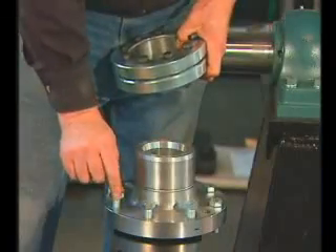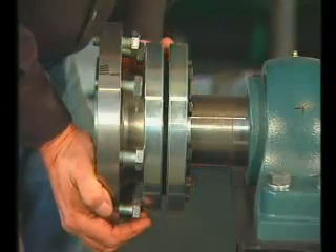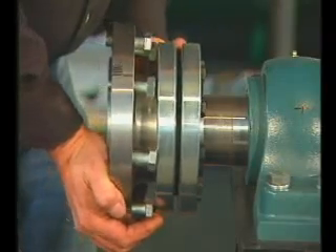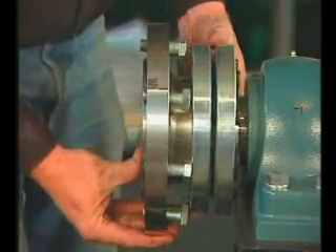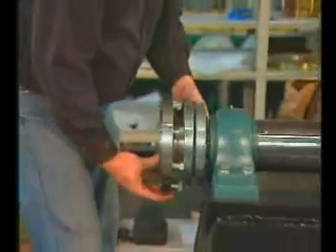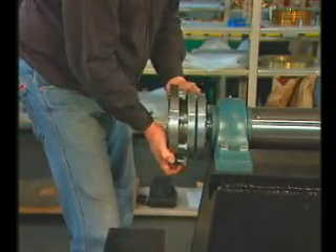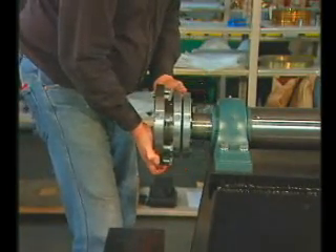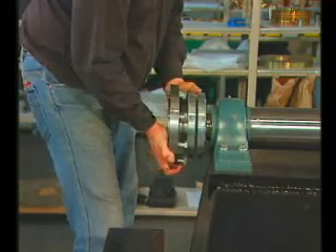Be sure to install the hub connection bolts and install the shafts before placing the shrink disc onto the hub. Shrink disc screws should be loose to allow the compression ring of the shrink disc to slide on the hub. Install the hub onto the shaft until the shaft end is flush with the end of the hub. If there is interference, verify clearance of the half key. Do not force this assembly. Hone the hub inner diameter to loosen the fit if necessary.